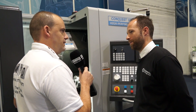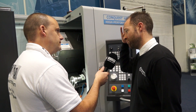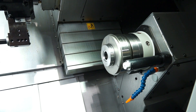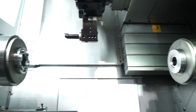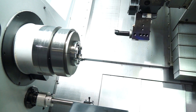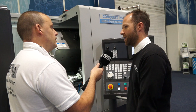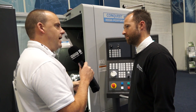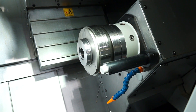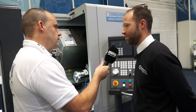What about the actual collet readiness of this machine? So there's no chucks, it's all collets? All collets. So again, it's renowned Hardinge spindles. The spindles themselves are built and actually ground integral to the machine — the spindle is placed on the machine and ground in situ. And that's what gives it its super accuracy. Is that the same on the front and the back spindle? Yeah, so both spindles are ground integral because obviously the transition between the two spindles, transferring the part, is obviously critical.